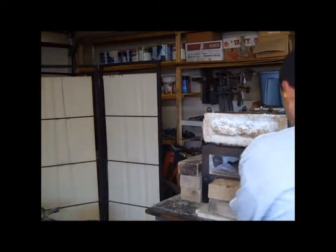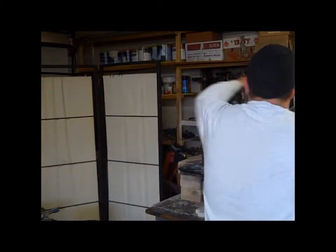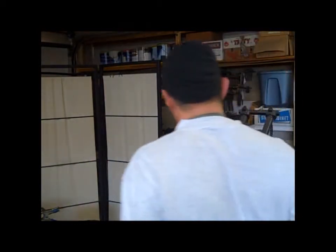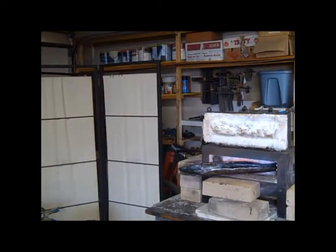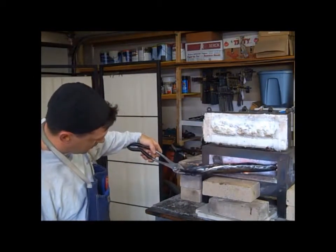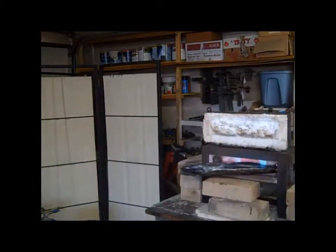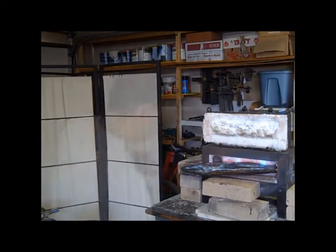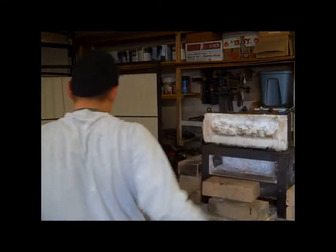Here's where I decided to go ahead and fold the copper over, rather than doing any more brazing along the bottom. That also gives plenty of copper to braze the bottom fins onto. When I braze those fins on, I use a copper phosphorus welding or brazing rod, and that doesn't stick to steel. So having that extra copper down there folded over helps those fins to stick to the body.